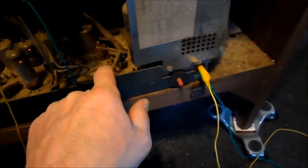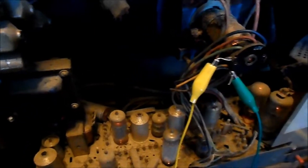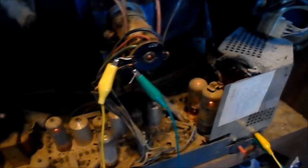You could smell the smell coming off of these tubes. I don't have an isolation transformer on this set right at the moment, so I'll do a little more digging around. I've gone ahead and taken my pins out and let's see if there's any type of raster on this set — there is no raster. I can hear the vertical. I swear there is a raster there — the camera is picking it up but I can barely, barely see it. It's just too bright in here. There you can see the top of the vertical right there.